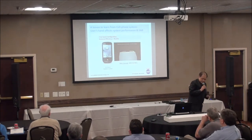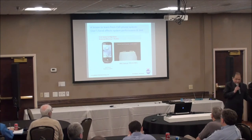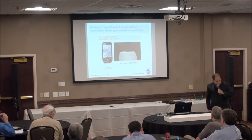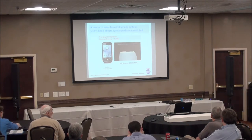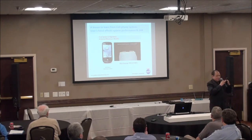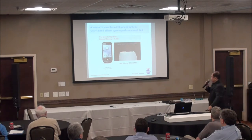Here's a lesson to learn from cell phone systems. The antenna runs along the edge of the phone. As soon as you hold the phone covering the antenna, it takes away 15 dB — that means 97% of the power. When they measure cell phones in air with no hand, no head, no people, the antenna efficiency is pretty good, about 80%.